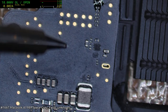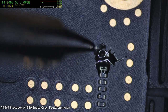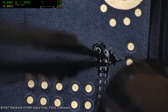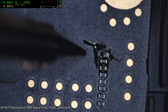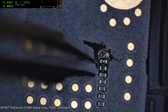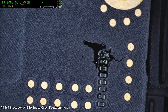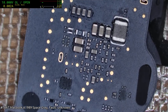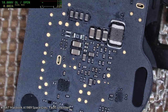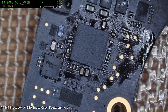Yeah, there must not be much of a ground plane around here, because these are lifting off real quick. Oh great, now I have got that. There's the end cap of the old resistor sitting on the tip. Alright, well, I can assure you that really would have nothing to do with the actual fault that we're dealing with. So I'm going to do a static analysis here.